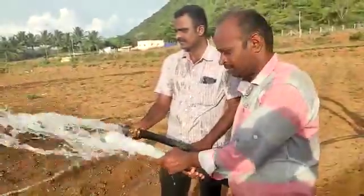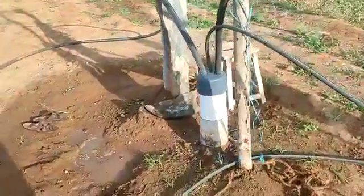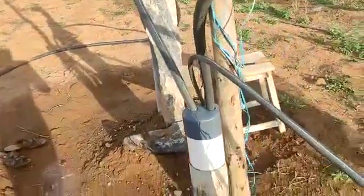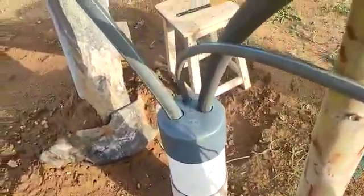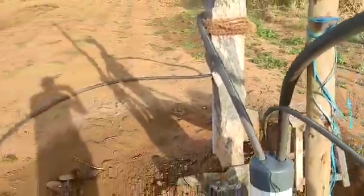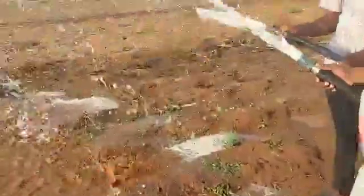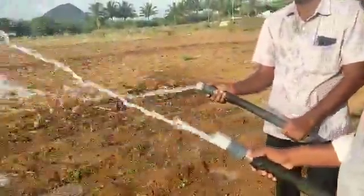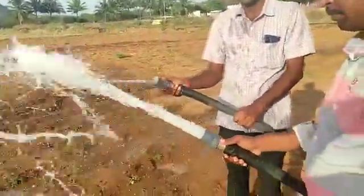We are doing innovative water pumping — you are getting water in two pipes. An air compressor rotates and gives pressurized air into the air pipe, delivering water in two pipes. That is double pumping. Water is delivered almost continuously in two 1.25-inch pipes — almost two inches of water you are getting from a single borewell.